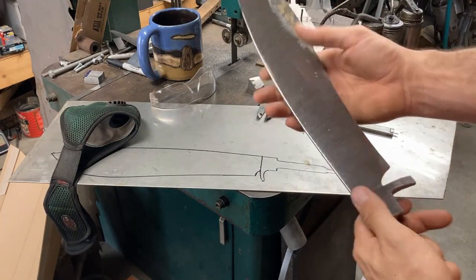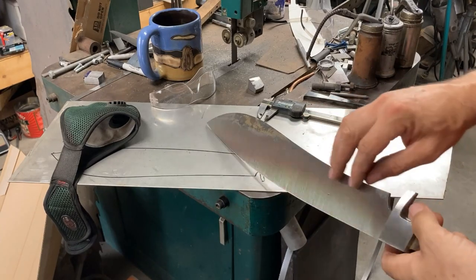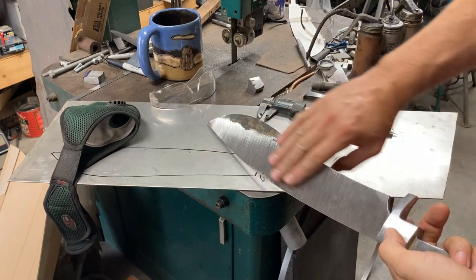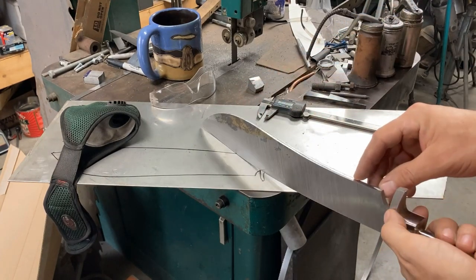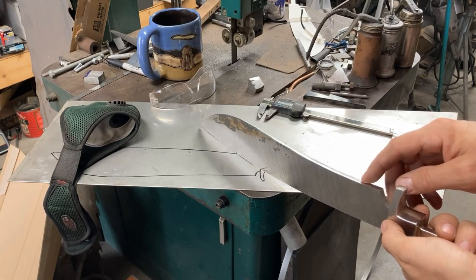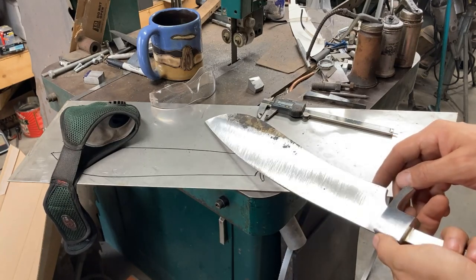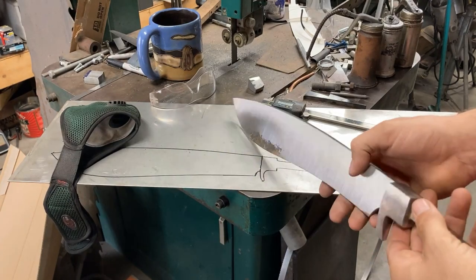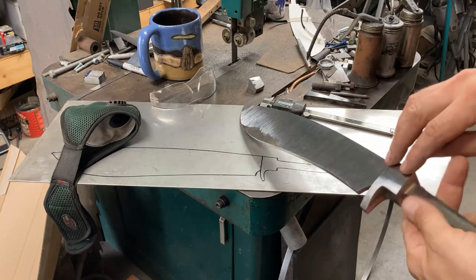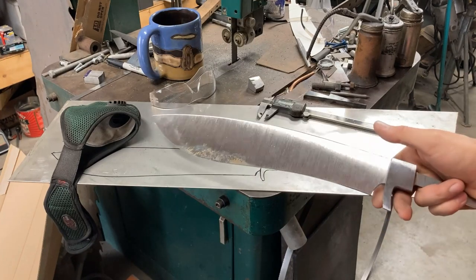Guard is big and chonky. We're going to actually grind a starter bevel on this and then actually start putting in the flat bevel onto this blade. We're going to leave our edge at probably 60 thou thick for now before heat treat because I don't want any big warp, and then we'll finish grind it all after heat treat. But once we get the bevel put on then we'll pay some more attention to blocking the guard down further toward a refined shape. That's where we're at.